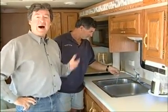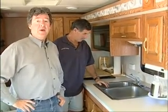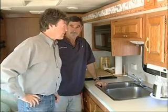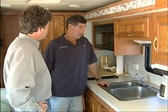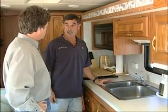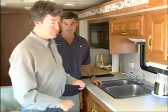We're talking about hot water today in our how-to project, because as all experienced RVers know, everybody wants hot water when you're out RVing, but we don't want it too hot, right, Bill? Yeah, that's my point. Typically all these water heaters now come with a 140-degree thermostat, and it's too hot. Now, Atwood does make an adjustable thermostat, and that's what we're going to install today. Right outside. Yep, we've got to go outside and do it. Let's get to it.